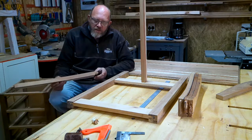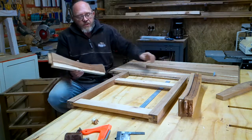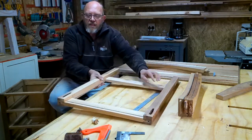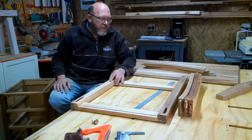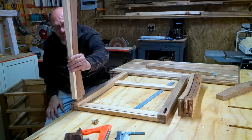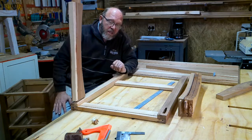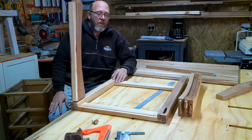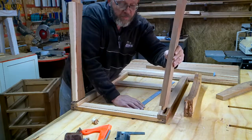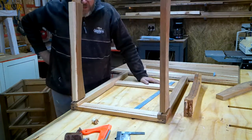For a restoration, when it's a square peg like this, and when the mortises aren't all the same size, I make them by hand to make them fit to the old holes, like you can see there. So these don't fit yet, they're not 100% there yet. They're close, but they're not all the way there, so there's still a bit of refining to do there on both of them. This hole looks like it's been hit by a bomb, so it's not all the way there, but we'll get them a final fit.